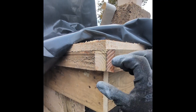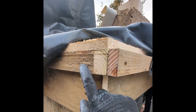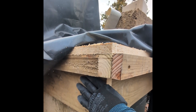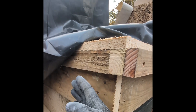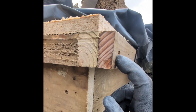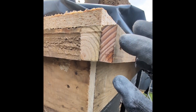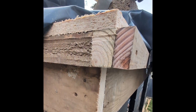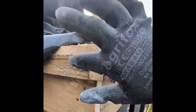In preparation for our roofing trims, we've added a batten all the way around the perimeter. My batten is 50 by 38. If your fascias are already on you can get away with using a simple two by one, but because my fascia is getting put on afterwards I've given myself an extra 10 mil there. On the front we've added an extra batten for the drip trim, because the drip trim is going to want to drip into a gutter and it needs to push out that little bit further. The OSB3 sits on top, flush cut all the way around to the first batten.